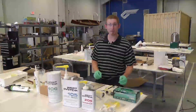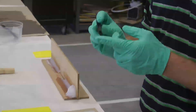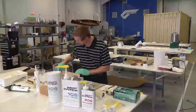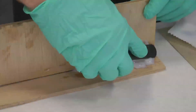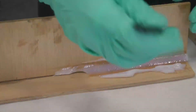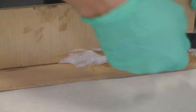The mixing stick also serves as a fillet tool. One end has a nice rounded edge — you simply place it at a 45 degree angle and drag it over the area. You can then come back with your mixing pot to take up the excess, and the sharp angle on the other end of the mixing stick can clean up any excess squeeze-out over the area.